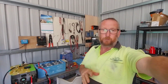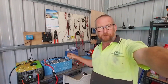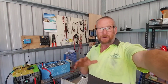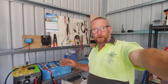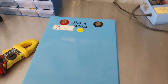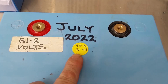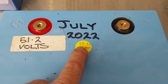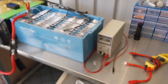Welcome to the off-grid homestead where we're doing another battery capacity test on this battery after I've balanced the cells. Looking at the case, the last capacity test gave me 86 amp hours out of a 100 amp hour battery, and the BMS shut off at 48.7 volts — which is way too high because these cells were out of balance.